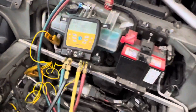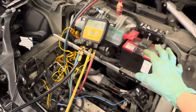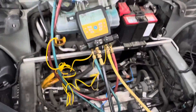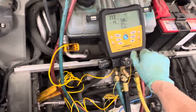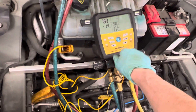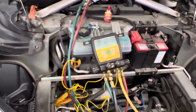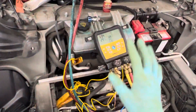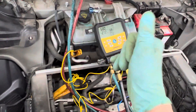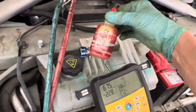I have the vacuum off right now. I was performing a vacuum decay to see how much moisture or refrigerant was trapped in the oil, and I still have to go down for a while. I'll do another 30 minutes and come back and see where it goes, because I'm trying to get it down and hold below 500 microns. Getting down to 500 microns means nothing — being able to hold below 500 after you turn off the vacuum, that's when it tells you you actually did some work. Getting there is easy; holding there after you turn off the vacuum proves whether or not you have done your job. Alright guys, I'll see you later — and don't forget your nylog on your fittings.